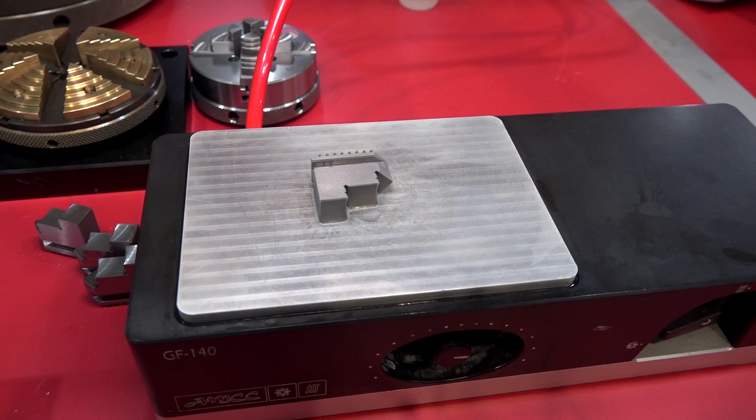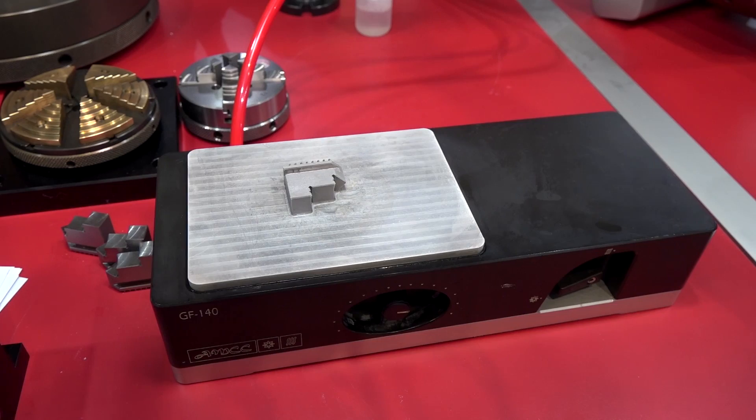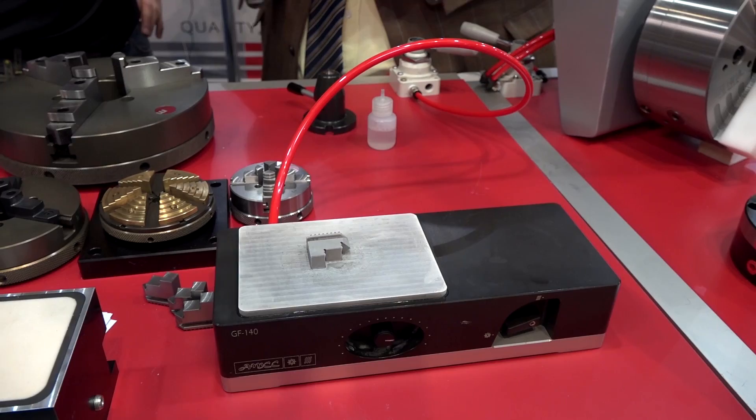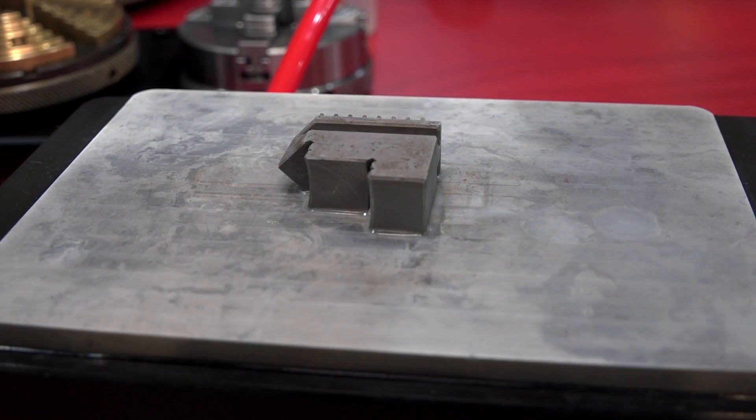Okay, so what sort of materials, Mark? Materials that we use to clamp on these ice plates are things that can't be held on a magnetic chuck, for example, or materials that can't be held on a vacuum chuck because perhaps of their porosity. Materials like plastics, and lenses — for example, intraocular lenses — which are ground on these plates before they're inserted into the rear of the patient's eye.